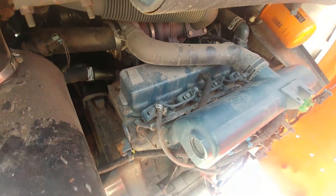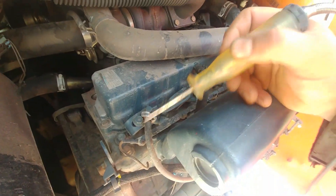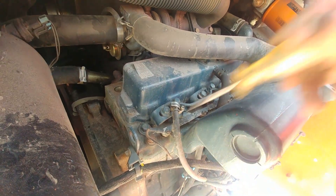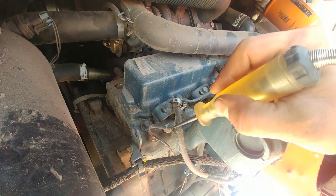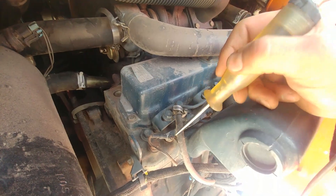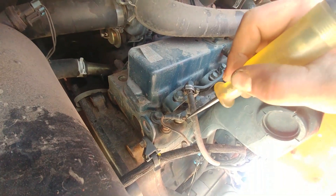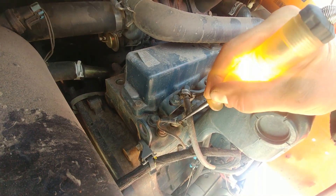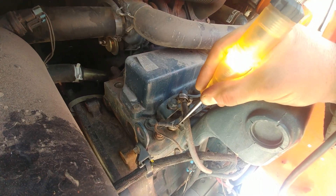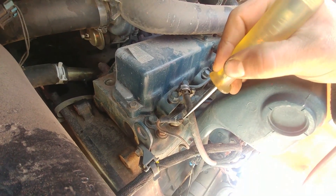What we're looking for is a bright light. There's a glow plug wire coming to the glow plug rail, and there are four cylinders on this Kubota diesel. As you can see, there's a bit of paint sprayed at the factory — we need to push it down to make sure we have good contact.